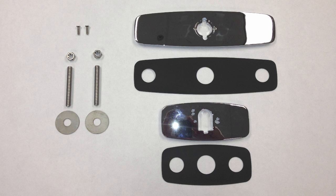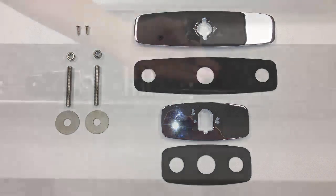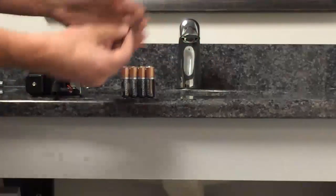In cover plate or four-inch spout base applications, use the two studs, two washers, and two mounting nuts to install the spout mounting hardware. Start by swiveling the washer and nut onto the studs, then while lying under the faucet, fasten the studs to the underside of the spout base or cover plates. Use the socket wrench with hex adapter to tighten to a similar snug fit.